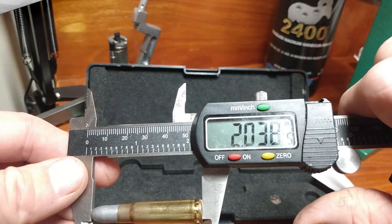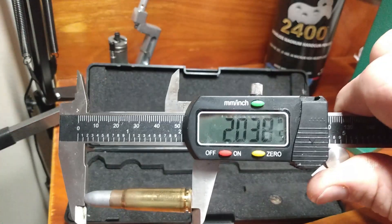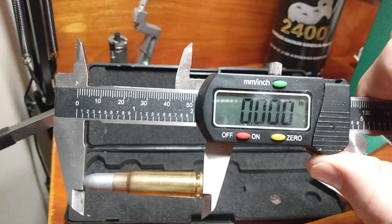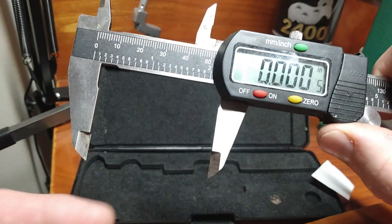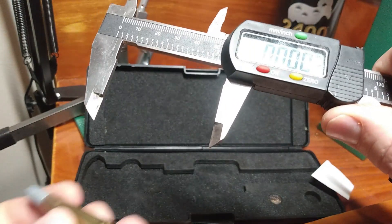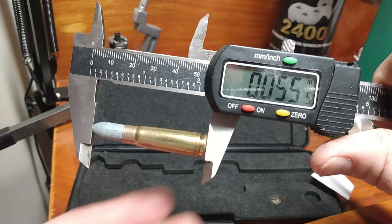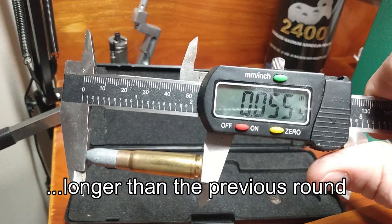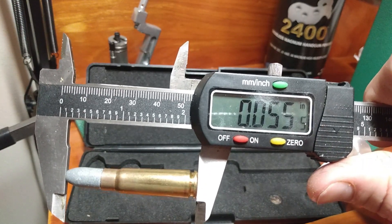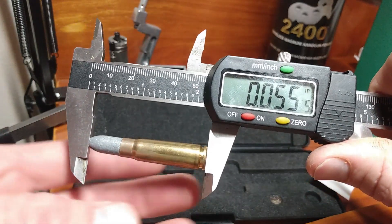I prefer dial. However, this does have its uses. Let's say that we wanted this to be our starting point for measurement — I can zero it out right here. This is now my zero point. From this on, I can check and see if maybe this other round is fifty-five one-thousandths of an inch longer. I could have done this with a dial caliper, but I would have just had to do it with some math, some scratch paper, or a really fast-thinking math mind, which I don't have.